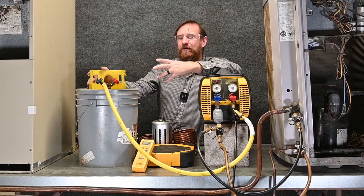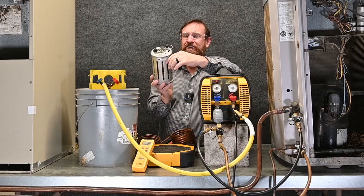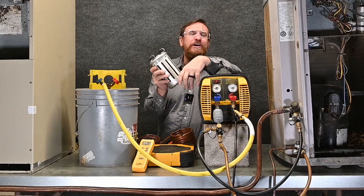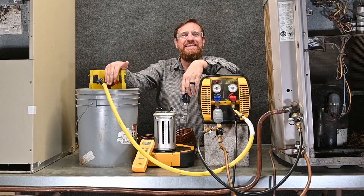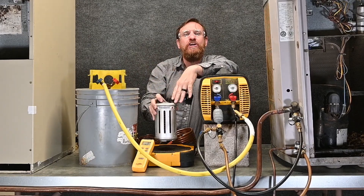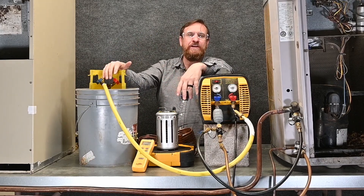While the ice bucket method works, there's a better option. They sell a product called a molecular transformer, which is really just a sub-cooling device. By hooking this up in series — the hose goes into this device, out of this device, and then into our tank — we're able to use heat transfer to sub-cool the refrigerant, drop the temperature, which also drops the pressure in our tank and speeds up the recovery process.